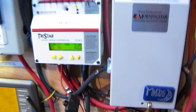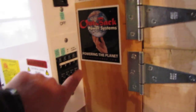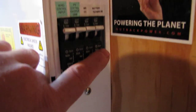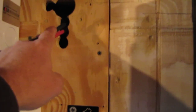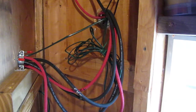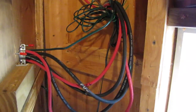Here's how everything works — I'll show you how I got my wiring done. This is going to the batteries right here, and it says 'Battery FlexMax 80 Disconnect.' My wiring is coming through here — where I used to have my battery switch — and all my wiring is back here now. It makes a much neater job. And that's just my extra battery sense cables.